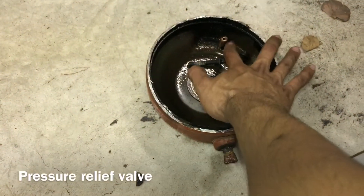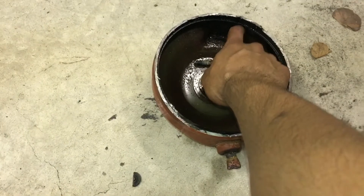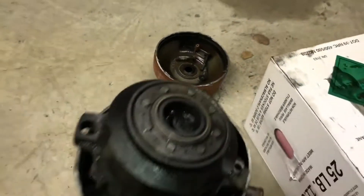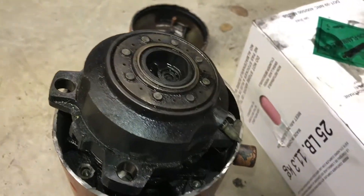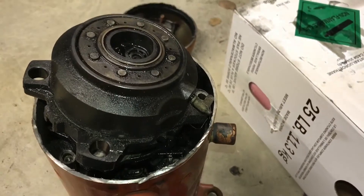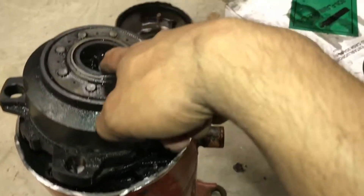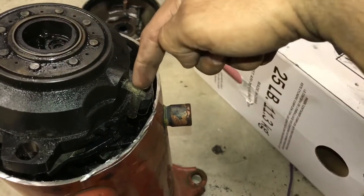Kind of similar with this — that's a pressure disc. When the pressure gets too high it will open up and shoot hot gas down into the suction so the overload will trip. This is connected here, so this is where the hot gas will go.